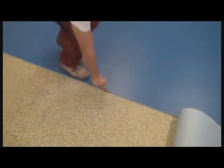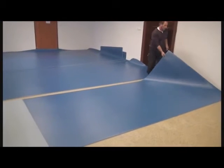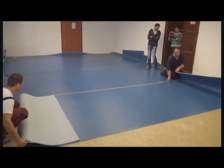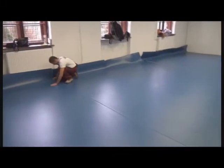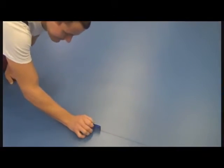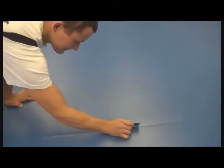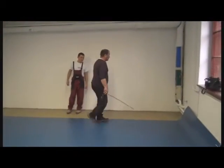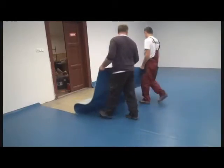Mark the center line of the hall by length and width, and start laying the floor from the central point. Normally, the direction of the floor laying is in the longitudinal direction. In special cases, for example in the case of a small-sized room, you can deviate from this. After relaxing, lay the floor strips next to each other, starting from the center, leaving a small gap between them. The size of the gap between the floor strips is similar to the thickness of a credit card. The width of the sports floor is 2 meters so that the number of joints is not too much, and the finished surface is more aesthetic. Pay attention to avoid that the joints of the old floor are not the same as the joints of the new cover.